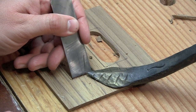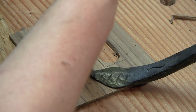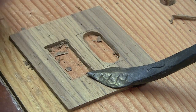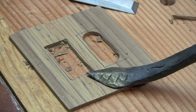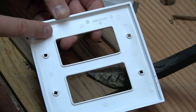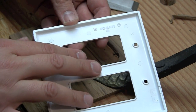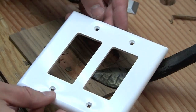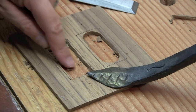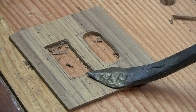While we want to focus on keeping the walls of this recessed area plumb, it doesn't have to be perfect because I've got to come back when this is done and slightly hollow out the underside. If you look at a typical switch plate, you see how it's hollow on the inside. That's because the switches and outlets themselves stick a little proud of the surface, but also with it hollowed out, there's a better chance of getting a tight seal around the edge. So if this isn't perfectly plumb all the way back, by the time I hollow it out I'll have that relief area that I need.